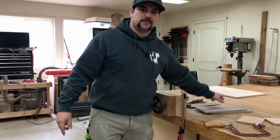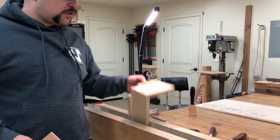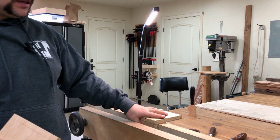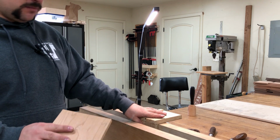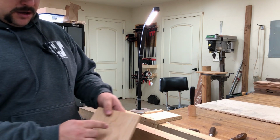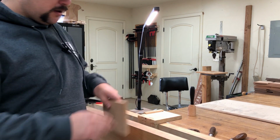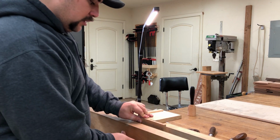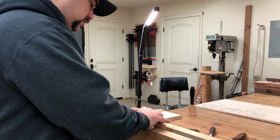To transfer the tails to the pins, we're going to use that dovetail alignment board that I was talking about. We're also going to be using labeling, and this is why we started that in the beginning. So as you can see here, I got pin out 3, so that's going to come out towards me. I'm going to put this in, making sure it's 90. Push that up.